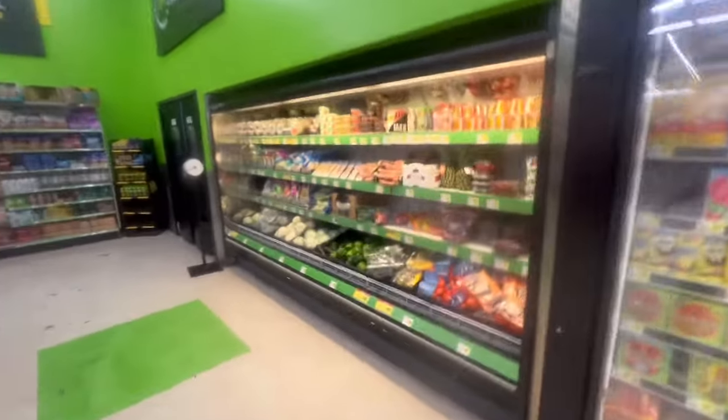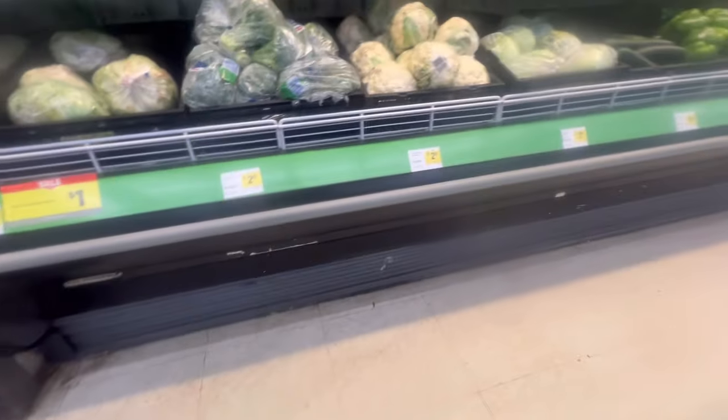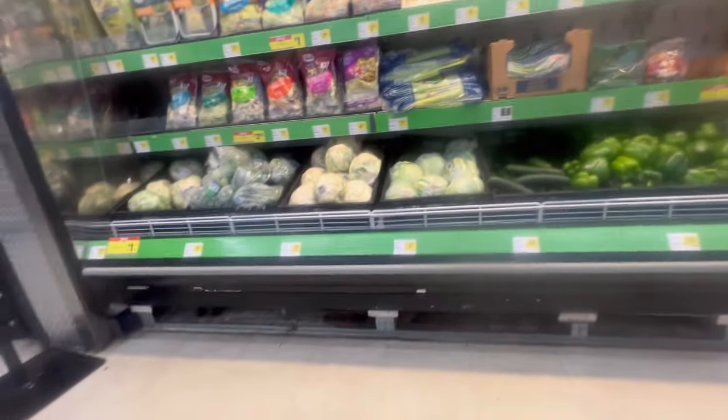All right guys, so we got a produce case — not running high temperature, but it's making a lot of noise. Y'all can hear it. More likely our drain is clogged up. So what I like to do is pull the bottom side out — it should be easy to come out, most of the time they're not. There you guys, as you can see I located my drain. First thing first, I'm gonna move this product out of the way, put it in the safe space, and check the bottom side. Got a little cart right here.